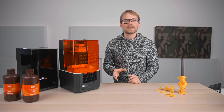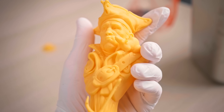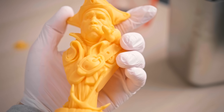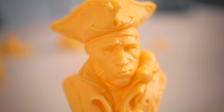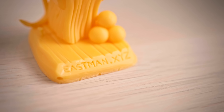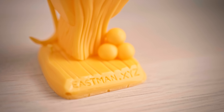While we're seeing these random lines on the prints from the Mars, the prints from the SL1 are super consistent without any of those lines visible. So even though the tilting mechanism needs to be super high-precision parts so that the position it returns to always ends up at the exact same height, apparently it does manage to do that and works really, really well.